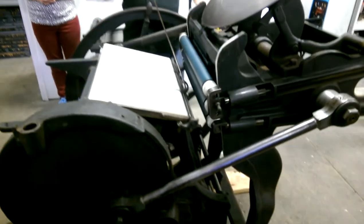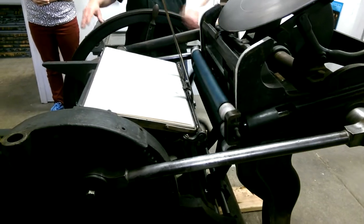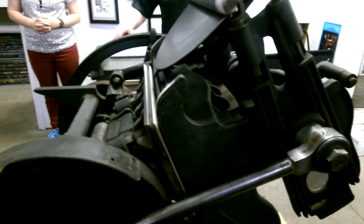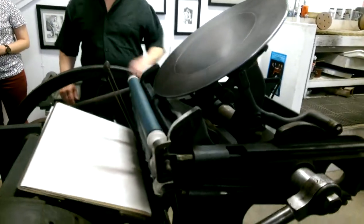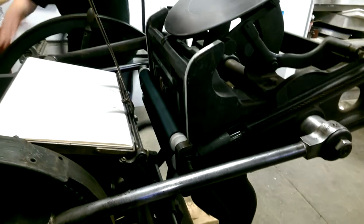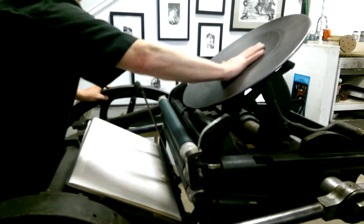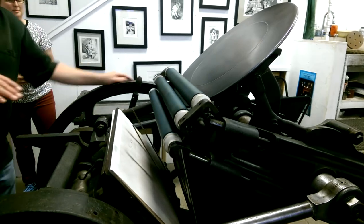This is me spinning the wheels here with lots of lubrication. Each one of these little holes that you see is a grease point. We've been working today as well as a number of days this week trying to get all the points, because there was a squeak we couldn't find. The squeak was on the rollers — it's rolling the ink on the plate. This is your ink palette, and it has a spinning inner plate so it distributes the ink properly.